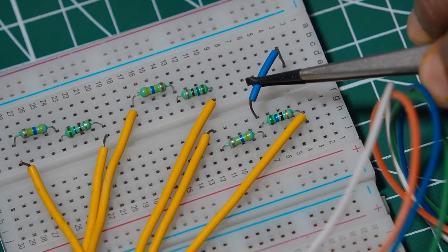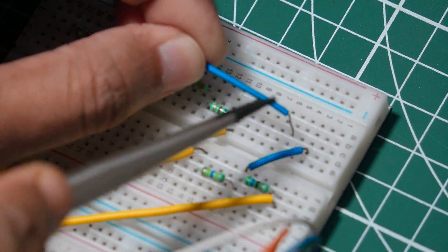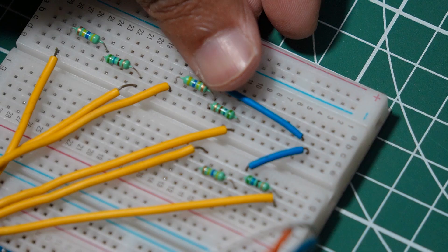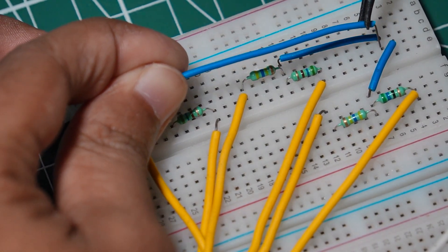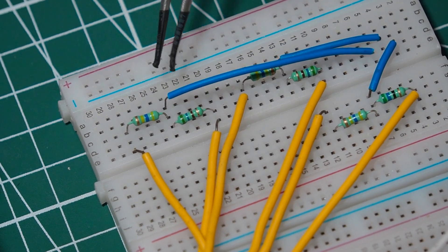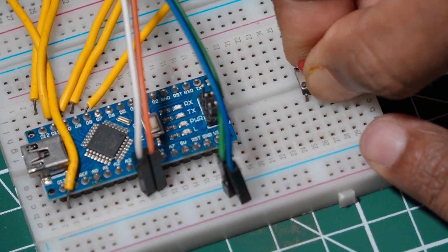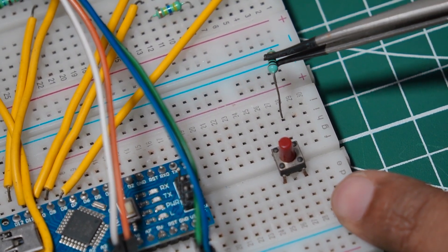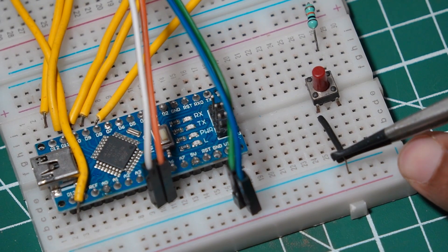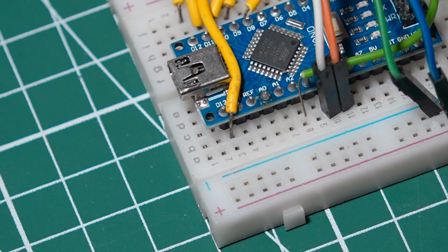Connect a jumper for test pin 1 from the middle of the 3rd series resistors terminal, test pin 2 from the middle of the 2nd series resistors terminal, and test pin 3 from the middle of the 1st series resistors terminal. Now place a push-button switch on the breadboard. Connect a 10 kilohm resistor at the VCC rail and one terminal of the push-button, and connect a ground wire at the negative rail and the other terminal of the push-button.